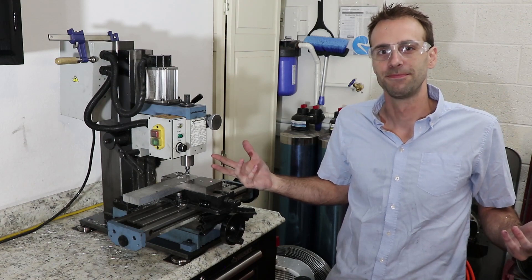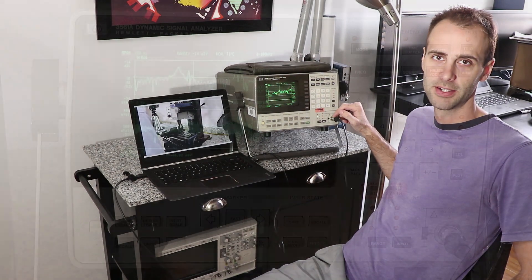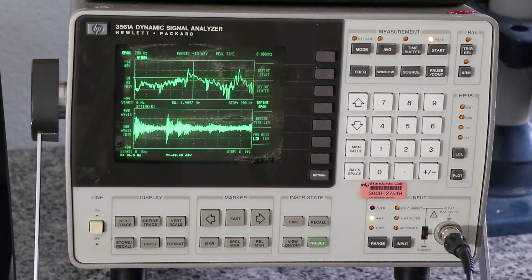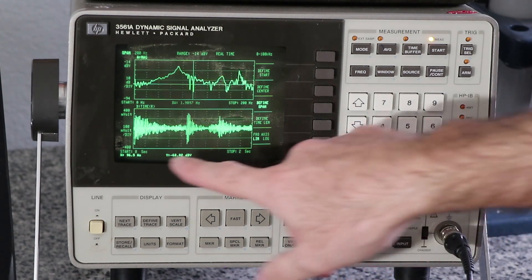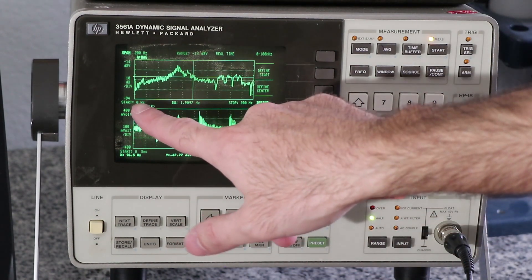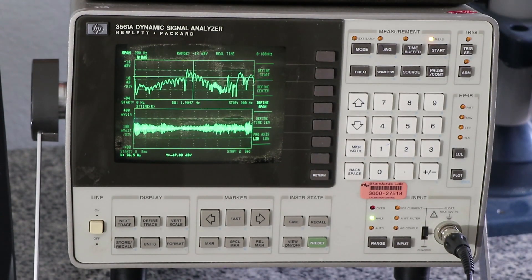Let's hit the lab and see what we can see. We're in the lab here with a 1990s era signal analyzer. We're basically looking at the footage from the camera through the headphone jack and plugging that right into the input of the signal analyzer. What this instrument does is take the input signal — in this case audio — runs Fourier analysis on it, charts the waveform on the bottom, and plots the Fourier analysis on top: frequency on the bottom axis and amplitude at each frequency on the vertical. It's kind of like a reverse equalizer in your home stereo system.